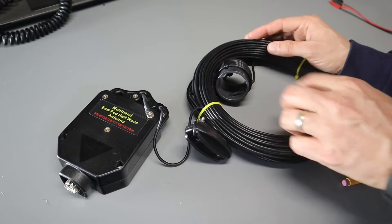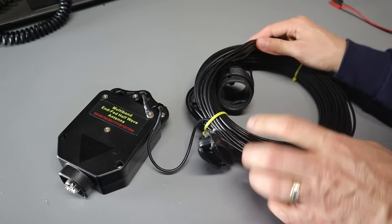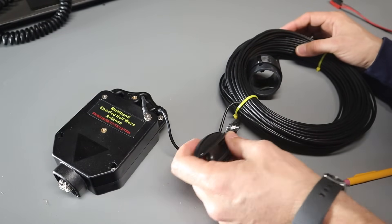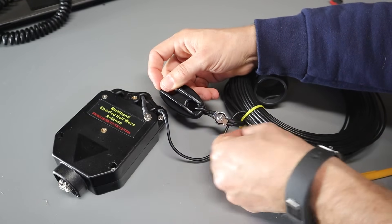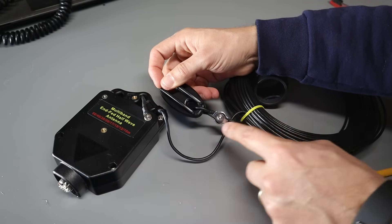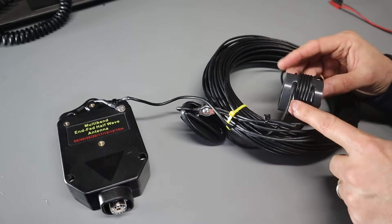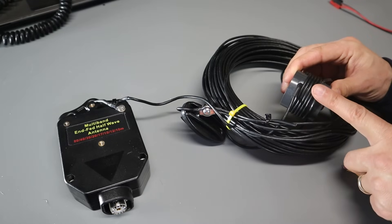As far as the radiating wire goes, there's nothing written on the jacket but I believe this is 14 gauge wire. It feels relatively flexible, although it is kind of heavy. At the far end there is a plastic egg insulator that we can use to tie off to. Right here we have a strain relief and the wire is doubled back, so if we need to do any tuning to lengthen or shorten the wire, we can just loosen this and adjust as needed. Closer up to the Unun side of the wire, we have this coil, and this is what allows the antenna to work on 80 meters.